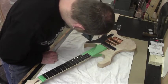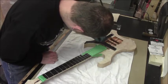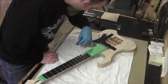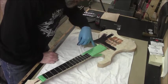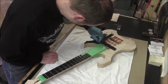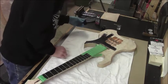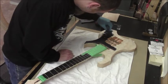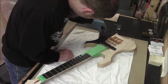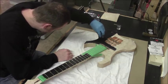Now we want to start working it out to the edges, and we want to be careful around this area because we're doing a full binding and we don't want anything dripping off the edges. I've run some masking tape around the inside because we'll be going at that with a brush, and I just don't want the brush to fall off the ledges on the body as they come right into the neck. They get pretty narrow and if the brush slips, better to have it protected.